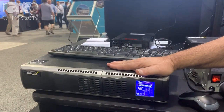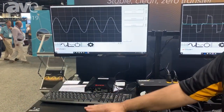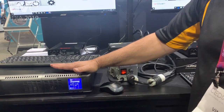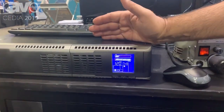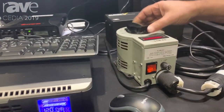Our UPSs are very robust. They have more watts available. This one has a 0.9 power factor, meaning that it can deliver 900 watts in the 1kVA unit, so it's efficient in that manner. It also can deliver impulse current quite well — 200% over current for a quarter of a second, which is very good in the world of UPSs.